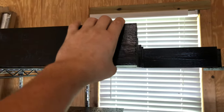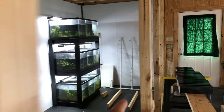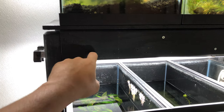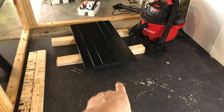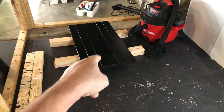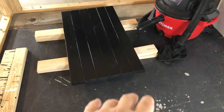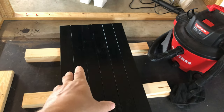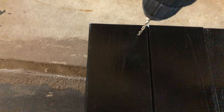What you'll need for this build is 12 long pieces at 39 inches — that's going to be this part. You can build it without seeing the screws; we're actually going to build this one without seeing these screws. I've got six of them laid out here and I'm going to drill pilot holes to get the screws in. I like to go what I call high and low on the placement.